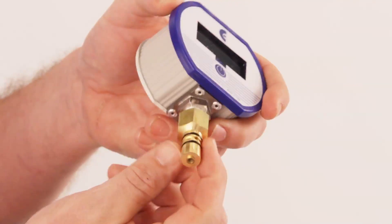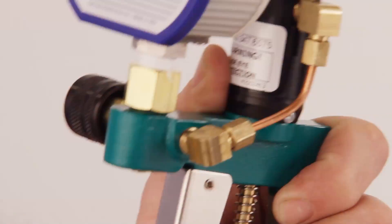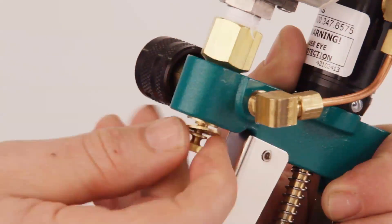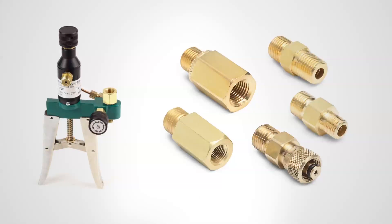If you're using NPT, use two turns of thread sealant and a crush washer or bonded seal for BSP. Grease the O-rings with silicone lubricant. Put the swivel fitting into the bore and attach with the set screw. If you're going to be swapping gauges frequently, the set screw is not necessary as it does not affect the seal. You can also attach one of our quick test adapters for an easy, no-tool, no-tape connection.